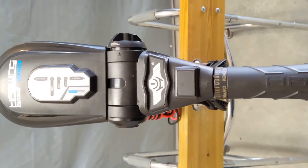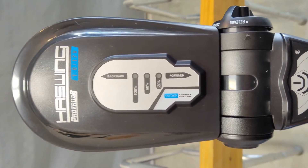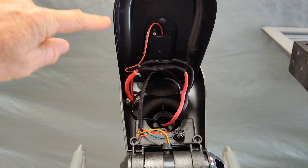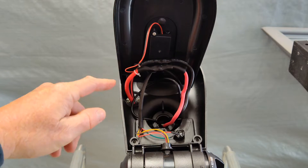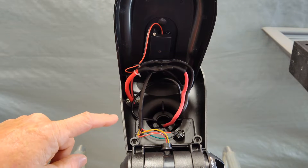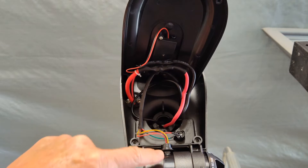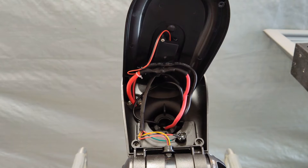This is an exterior view of the head unit for the Haswing Pro2R. I'm going to open up this top section here so you can see the wiring and the electronics inside. Up in here where you have the red and black power wires, that's going to the voltage meter. And then you have your positive and negative power supply that goes down into the shaft for the motor. And then you also have this coming out of the motor, which is a set of three wires that go to the potentiometer, and then these two wires that go to the little beeper alarm section. So I'll be disconnecting all these things to shorten the shaft, and I do have a video for that which I'll list in the narrative section.